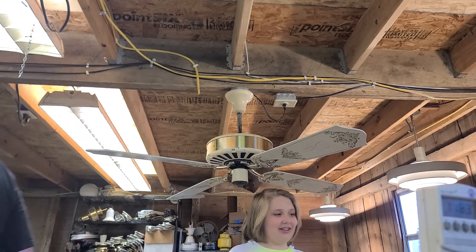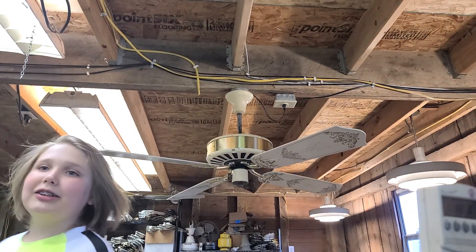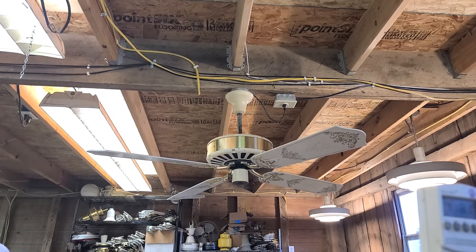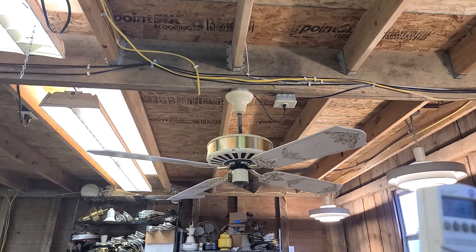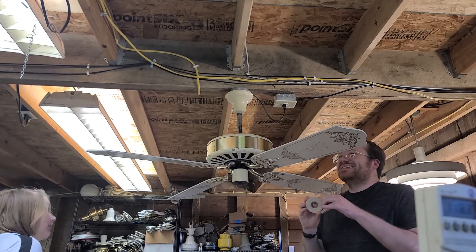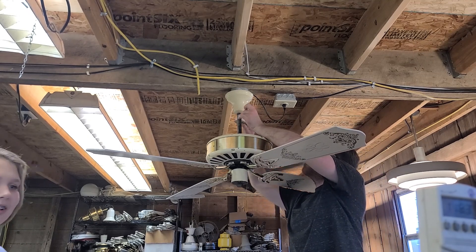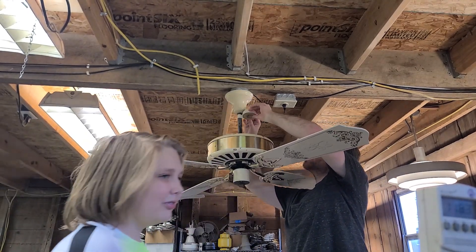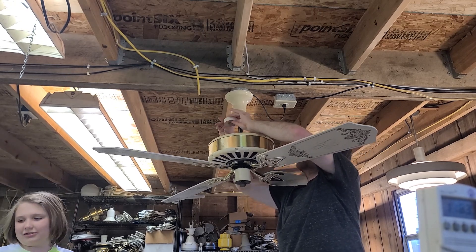Hey, let's test it real quick. Hold on — before we do it, I want somebody to be under it because of that kludgy bracket. Let's wait before you give it power. We have a 300-watt bulb right here to initially test the fan — to make sure it doesn't have a short. It's a safety measure: if it's shorted, you just get a bright light.